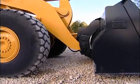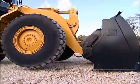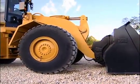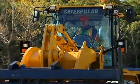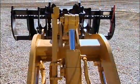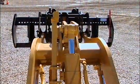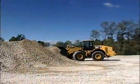This does not confirm the attachment is locked into place. Check engagement with the work tool coupled. Back drag the attachment to ensure that the wedges of the coupler are fully engaged. Do not back drag forks, however. Instead, raise them to where the wedges are visible. Then, carefully tilt the forks forward to confirm engagement. Once confirmed, your attachment is now ready for work.